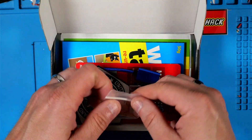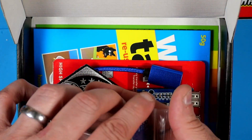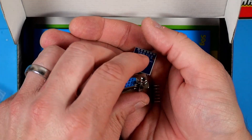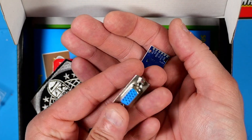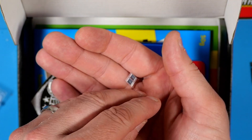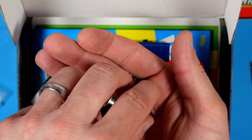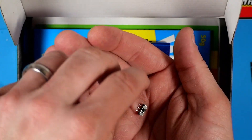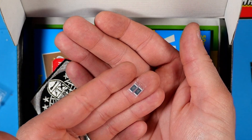This looks like a bag full of small parts that go with our HackerBox edition Pico Micro Mac kit. We've got a female DB15HD VGA connector, a micro SD card module, two six-pin headers — one of them is the right angle style. We've got some 68 ohm SMD 2512 resistors and some 100 ohm SMD 2512 resistors.